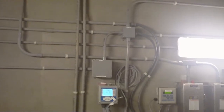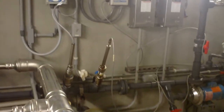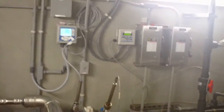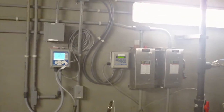The process control that is normally used for the raw water oxidation is ORP, and you can see that system on the wall. The ORP probe in the line is inserted through a ball valve for easy removal.